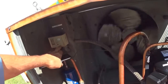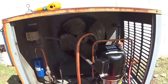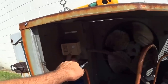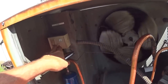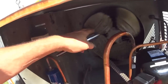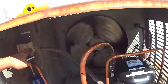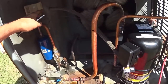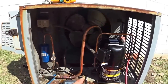Hooked up the pressure control to the compressor. What we're going to do next week is change that to a dual pressure control — low side and high side. If the fan stops working or the condenser gets plugged up, the high side will sense the high pressure — the head pressure will get way too high — and it will shut the compressor off. It's a good idea to have that on there just to help protect the compressor.